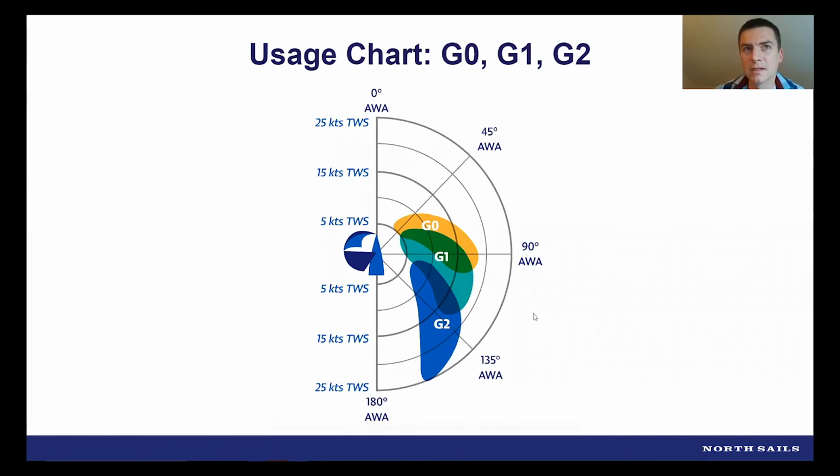So the whole idea is we start trying to share loads between these cords, these cables, and the sail material itself. And with that, what's happening is the tack loads are starting to reduce. And the cables then become designed so they're not as bulky. There's less strain. We're allowing it to strain a little bit more. Cables are a bit thinner, a little more pliable, with less tack loading. So that's a whole topic to be able to talk to your salesman about, but it's something definitely that we take into account.